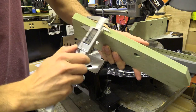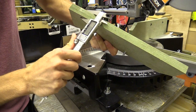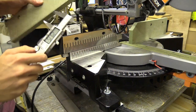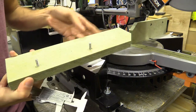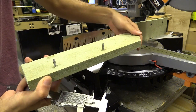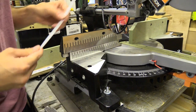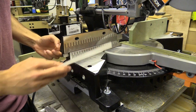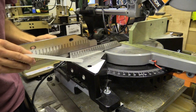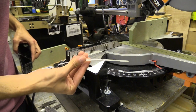I've just checked the pieces and they're all pretty consistent – 18.8 to 18.75, so that's not too bad. What I should have done was put some pieces of velcro mat across to check for any twist when it was gluing, but I don't think that's the problem. So what I'm going to do is shim this out so the wing nut at the back isn't pushing this too far forward. If I loosen that up, you can see there's a flat edge here – I'm going to use this piece of PTFE, it's 0.25mm.